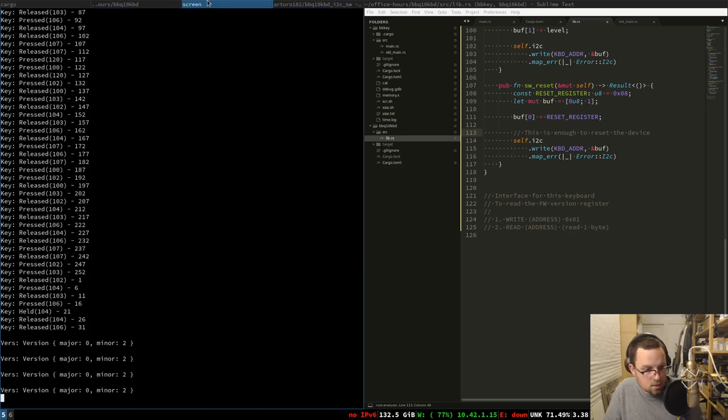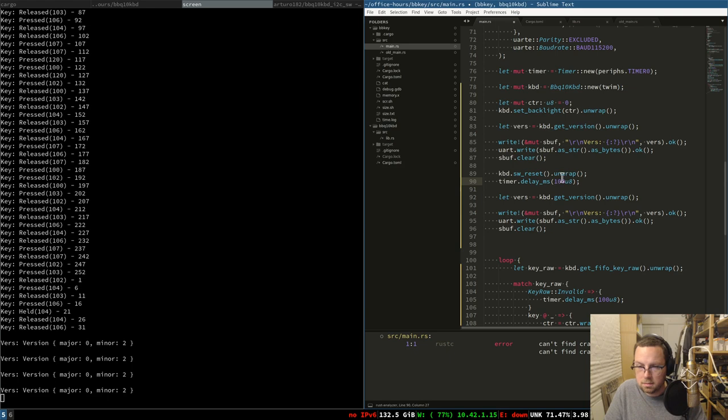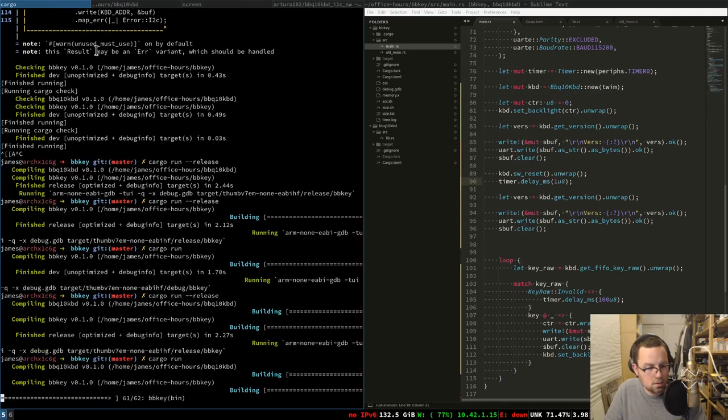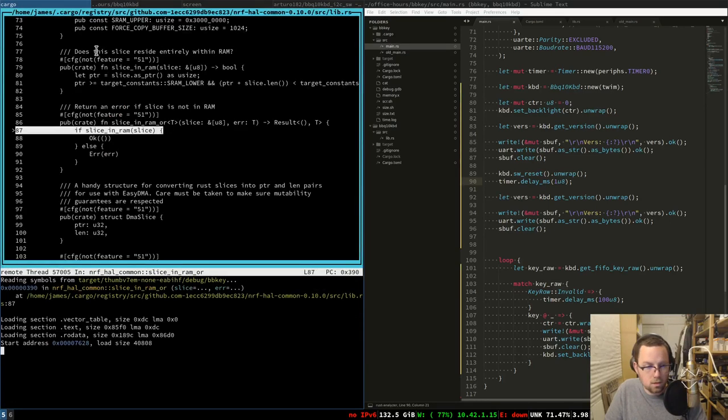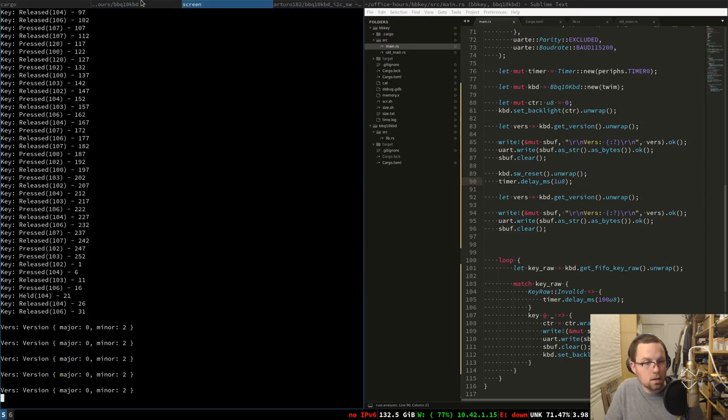And no, we've managed to... See, the thing is with the NRF52 drivers, they don't have a timeout, so I'm wondering, I bet you if I were to throw a delay in there of like a millisecond, it's going to work. No, interesting. Where are you getting stuck?